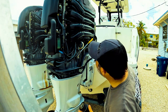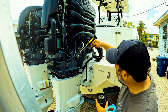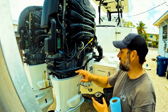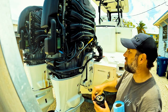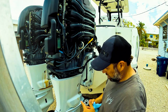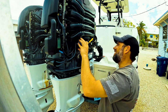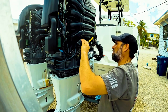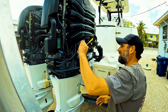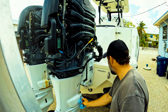First, don't pinch the filter too tight with a pair of pliers when you put it on — they only need to be hand tight and then some, not plier tight. Second, coat it really good with some sort of coating. I also noticed by taking the cowling off, there's a zerk fitting right here on the shaft with the shifter so I can hit that grease fitting — definitely a better plan to take those cowlings off. A little bit of oil on the gaskets — one of those old tradition things. Hand tight, and it's going nowhere.